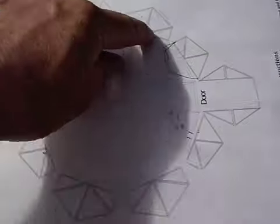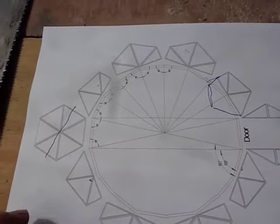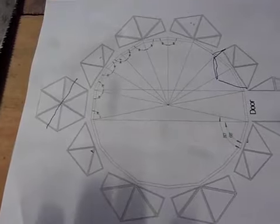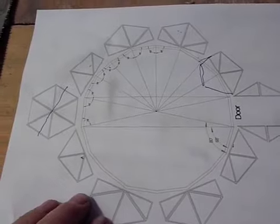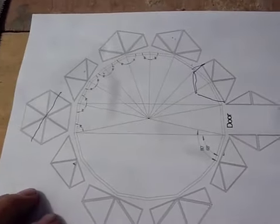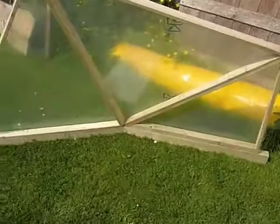Some people have tried to build the whole circle first and then mount all the panels on top, but it's absolutely a nightmare - if you don't get these angles and lengths exactly right, it will either overhang or underhang the base. This is a much neater, simpler way of doing it. There's no measuring. All you have to do is cut one end at this angle, then chop that off straight when you're finished, and from there your panels can just be built on site as normal.